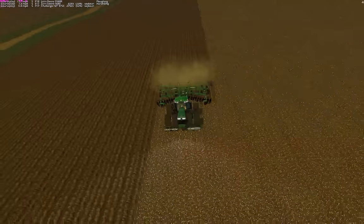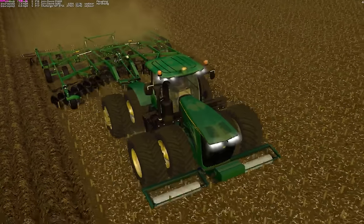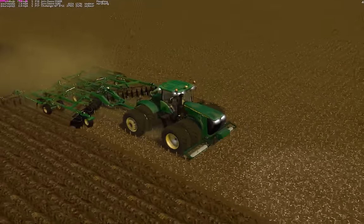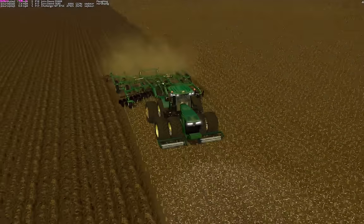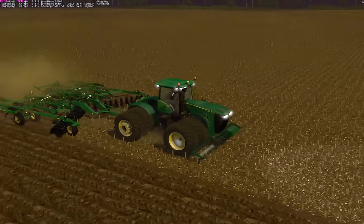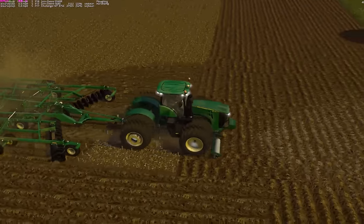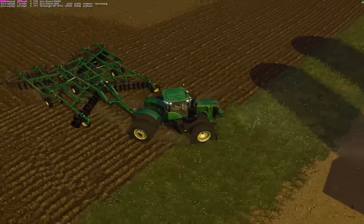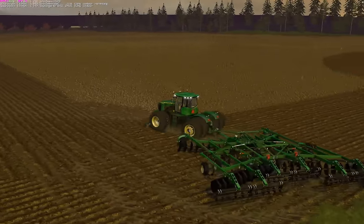You're supposed to run your corn at a slight angle offset to your rows, and it chops up your corn stalks, all the residue, and those root balls. It basically slices and dices, and then agitates and aerates, getting air in there for all those bacteria and earthworms, those facultative anaerobes and aerobic bacteria. They love that stuff and get that fresh nutrients, that food they love. Then they'll degrade that down into the basic elements, your nitrogen, potassium, phosphorus, and calcium, and all the nutrients go into the soil. That's basically all the discs do.